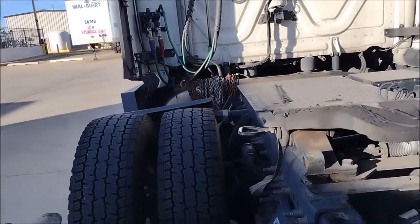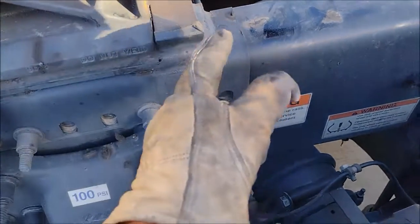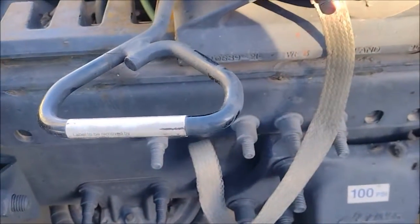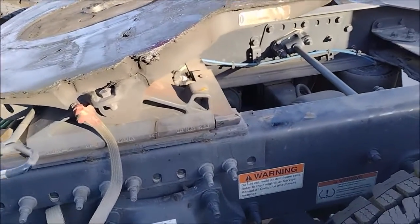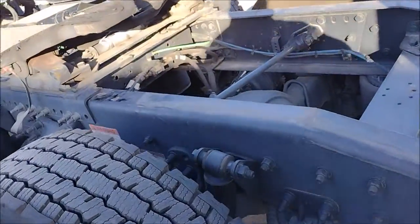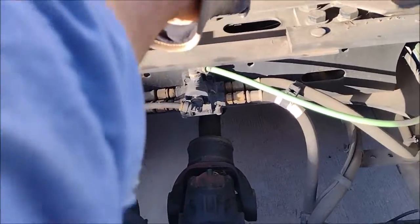How do you know what is front, what is back? We are going to look at this space right here. This is back. That fifth wheel is back. In the front, you have 1, 2, 3, 4, 5. When I go under the trailer, I need this one to go front and back smoothly without getting jammed. So I will take it under the trailer to test the mobility of the slider with the pneumatic piston retracted. Just put it down first.